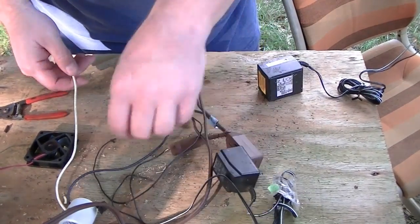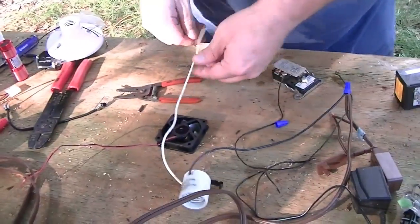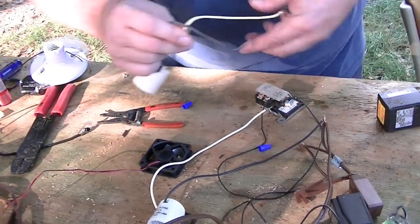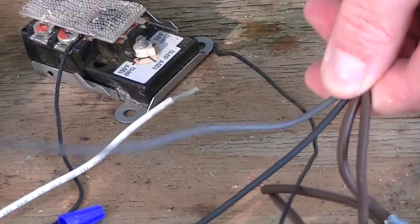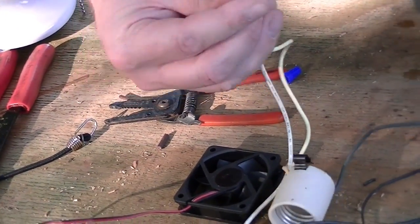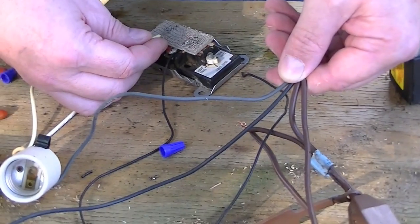If you're going to wire in two bulbs, like I usually do with most of mine, all you have to do is match black to black and white to white together — that's all you have to do. Same principle: these two together will go into the thermostat, and then the wire runs out to the other side of your power source, just like that.